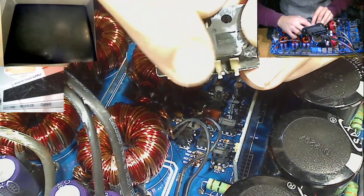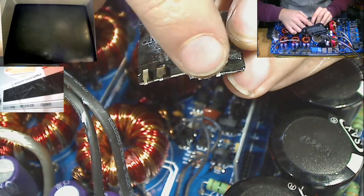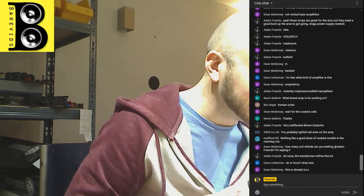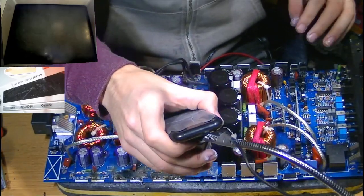there's a high chance that we didn't get much 12 volt current going back down the gate line towards the drive transistors, because it was all being used up cooking all of this stuff. So there's possibly a chance that the drive circuit may have survived and may not be damaged. Another telltale sign to know whether your drive circuit might have survived is the condition of the gate